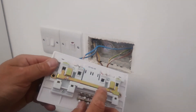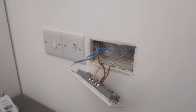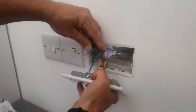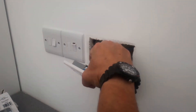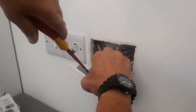In the old socket these holes were a bit deeper, so you could put the cables in and they would go down to the insulation line. So that will go in there like so — blue into blue, brown into brown. Tighten it down.